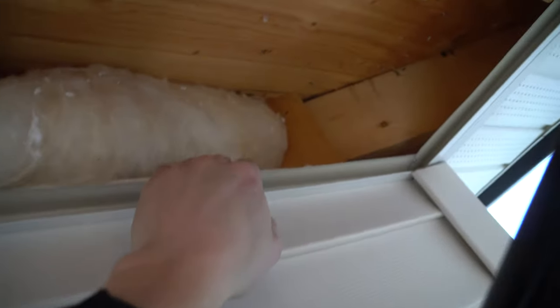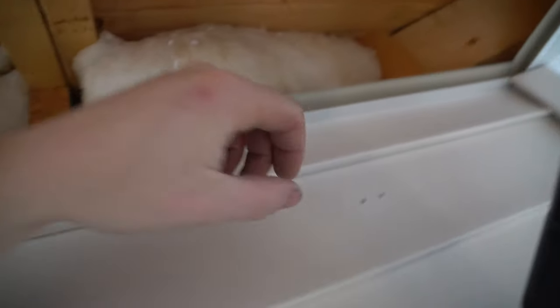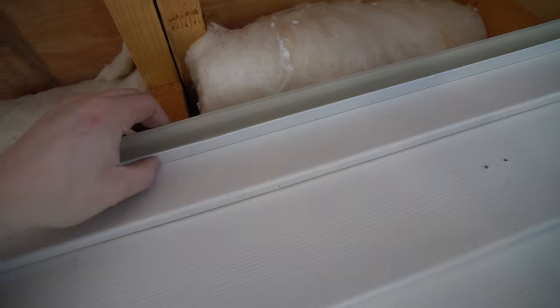As you can see, this is all one length. I have to take off the ridge and also remove the screws along the beams up top — these are holding your top first sheet on. Go along and remove these all the way down for the length of your pergola. You can actually leave the metal piece hanging up there if you want — you don't have to take that off. Majorly you've got to get these siding panels out. Go up to the very end of the panel, make sure you get that screw out, then go along to each beam and take out the screw, pulling the first flashing off. Then go to the next flashing, take those screws off, and so on.